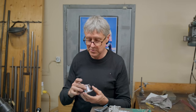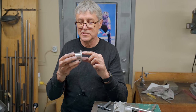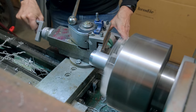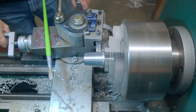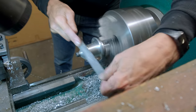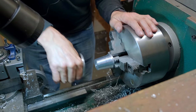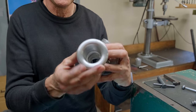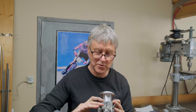Next thing to do — we have to drill a couple of holes here. I'm going to make a five-degree insert so we can hold this in the rotary table and get the holes 180 degrees apart. We're making this fit the carb. Oh, look at that — all it needed was a few thou. When you're looking down the bore, look how smooth that is. There's no step, nothing — just a smooth, smooth transition. That's one of the ways you make 35 horsepower out of a little Amal.